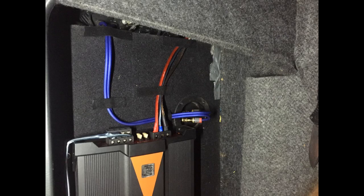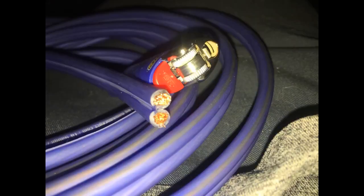Tip: For all twisted wire with fine strands, carefully cut the jacket so as not to cut any of the copper strands. Remove the insulation while twisting it the same way the strand cords are twisted, and you will end up with a tightly twisted wire that isn't frayed out.